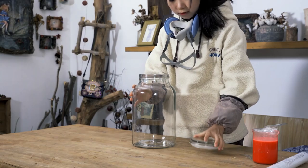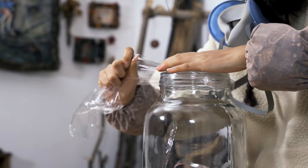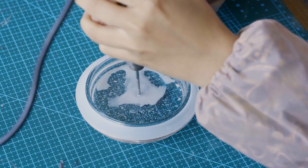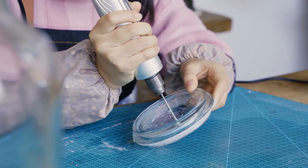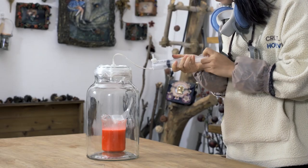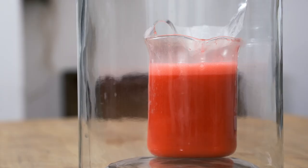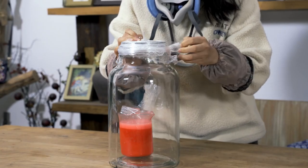In Chao Chen Feng's Cyberpunk katana video, she builds this small makeshift vacuum chamber out of a spring clip jar to de-gas her resin. She carefully drills a hole in the top and then seals it around a tube, and then uses a hand pump to pull the vacuum. If you only occasionally use resin in your shop and you haven't committed to a purpose-built pressure pot, give this one a look — it might just be what you need.